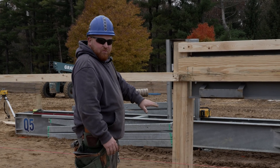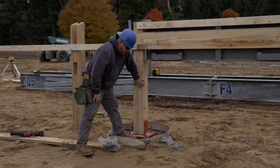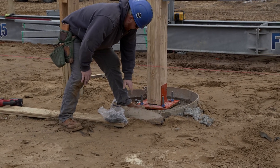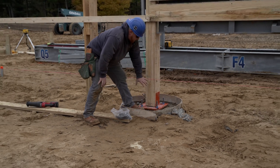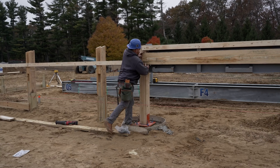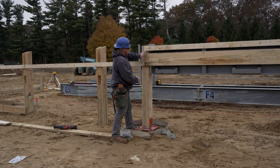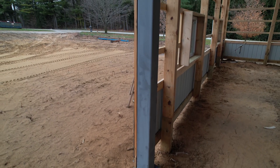So we're back on the sidewall with the finished product. This is temporary — once everything goes up in the air, this main column is going to get switched out for a permanent column when we get to the 20-foot eave height. Basically, we've got our base bracket shot to grade, our studs on, GRK'd in, bolts and washers fastening everything down. We've got our I-beam height, and back behind here there are temporary ears that fasten to the I-beam itself. Once we get everything up in the air, this will all come apart and we'll put our main permanent steel beam in.